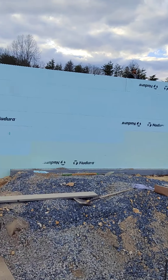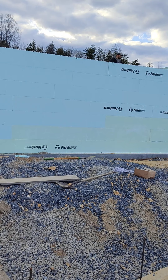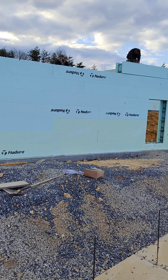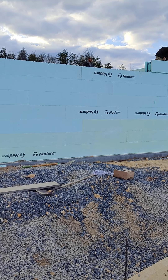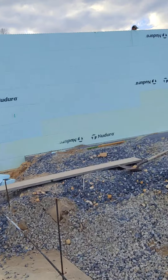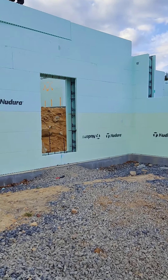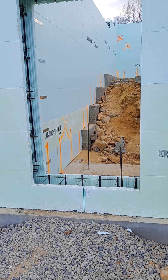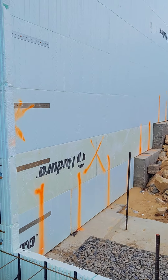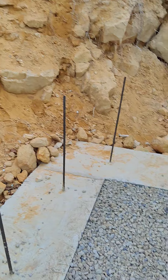It's going to save — potentially with all the fill it would have taken to bring it up to that other level — making this decision is going to save on material for the framing of the concrete forms, the fill, plus the drywall on the inside and everything that has to happen there. That possibly could save about sixty thousand dollars if not more. The final basement height will still come out with drywall and after everything's finished to approximately eight feet ten and a half inches — and the one at my house is 93 inches, not even eight feet, so we're gaining decent height there.